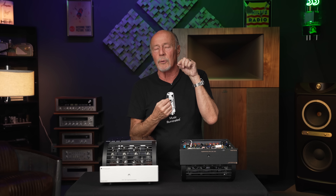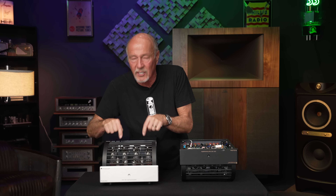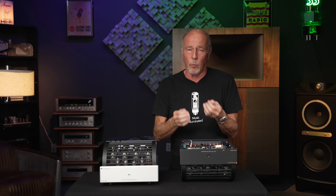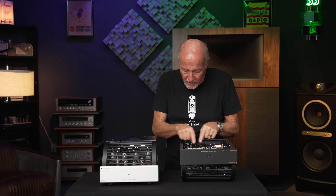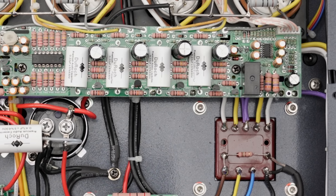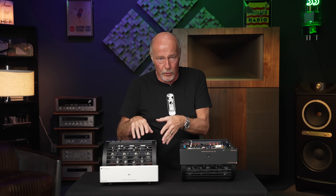Going to the front of the amp, you'll see our beautiful adaptive auto bias board. PrimaLuna invented a truly adaptive auto bias. I've seen companies call their boards auto bias, but they're just a servo — you set the bias once and if you change tubes you have to reset it. That's not auto bias. Our adaptive auto bias cuts distortion, and more importantly cuts distortion when you turn it up. As the tubes age unevenly, if one gets droopy prematurely, adaptive auto bias works as hard as it can to make sure you don't hear it, extending tube life with no fuss.